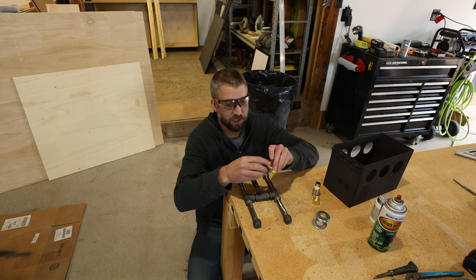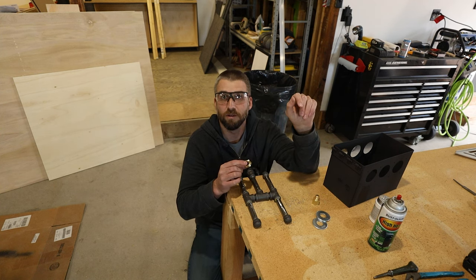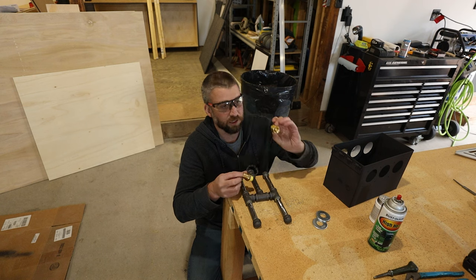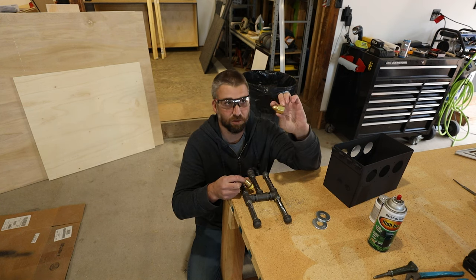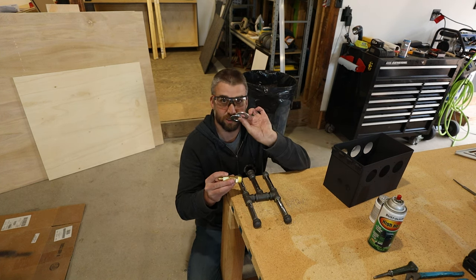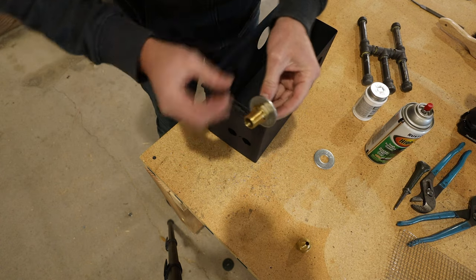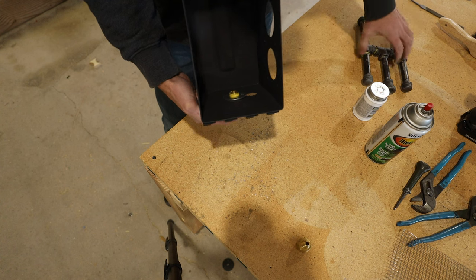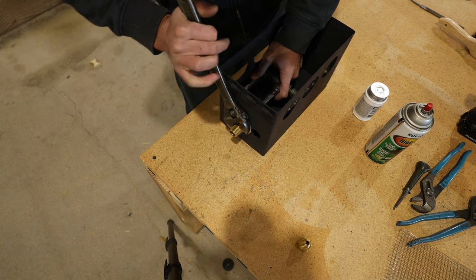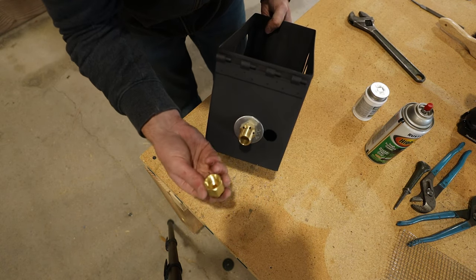From this point, take your air mixer — it usually comes with a little stainless sleeve, you don't need that. The air mixer helps give a clean flame with less black smoke. Then take your half-inch NPT to three-eighths male flare. These will be on the outside with washers in between. Take one of your washers, put it on there — this keeps the whole thing straight and adds stability. Put the other washer on, put your whole H assembly inside, thread it in, and throw on your flare nut.